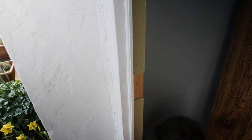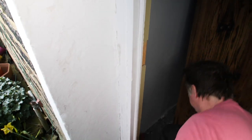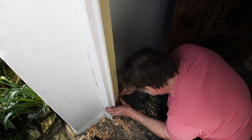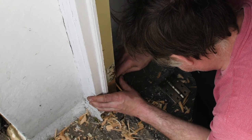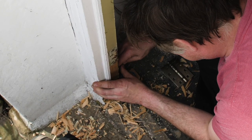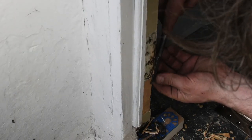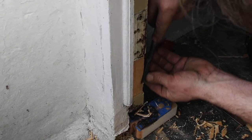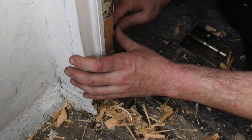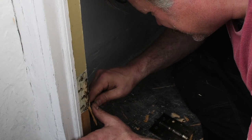So you're cutting in your hinges? Yeah, cutting them in. Because these have got a barrel on them, I'm just letting in the barrel, and the bottom of this door's rotten. So what I'm doing is I'm just allowing for the barrel. I'm very dangerously cutting towards my finger, but the chisel's nice and sharp, which makes the likelihood of a good old-fashioned stabbing even better. It's just a bit awkward to work. Don't film this, because it's as rough as a bear's ass. But it's just the wood. I hate working with pine. But to make a surround for this door would have probably doubled the cost.